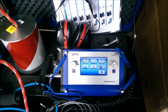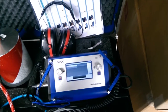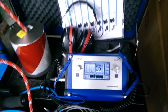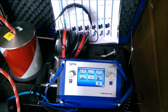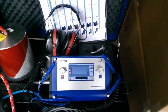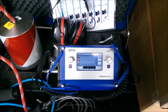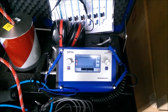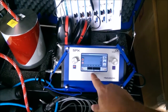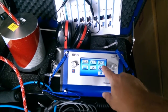On the main menu there are seven different options. The first option is acoustic listening mode, which allows you to go ahead and start finding the leak by listening for it. The next option is long term acoustic measurement mode. This will listen for a period of time and find the lowest leak noise level and give you that frequency, which you can then use when doing your acoustic listening.